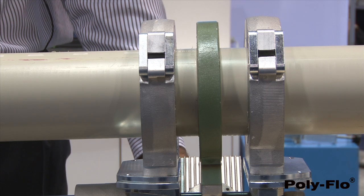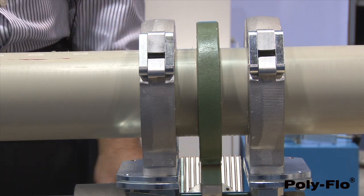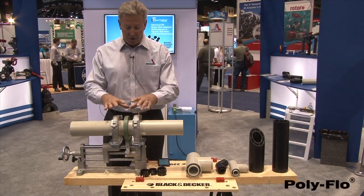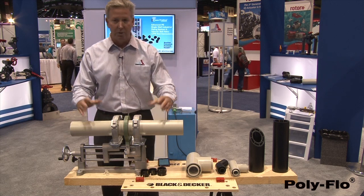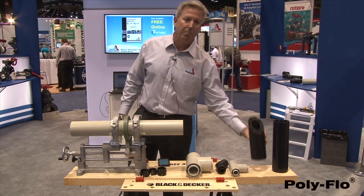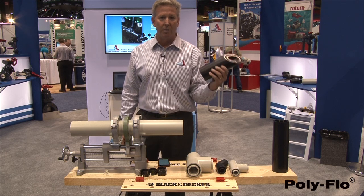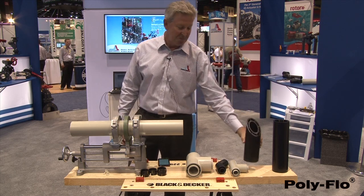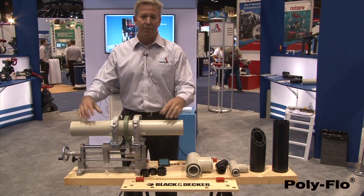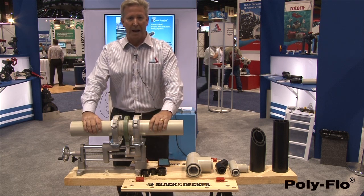We're looking for a bead to develop. It happens very quickly. At that point, we back it off to what we call the heat soak time. It's a simple 80-second cycle at that point. This is heat soaking the material now. This is the Chem Proline material — this is fantastic for applications like sodium hypochlorite, sodium hydroxide, and many other chemicals. This polypropylene material is very good for applications such as wastewater to hydrochloric acid.